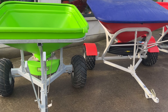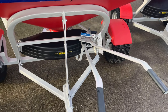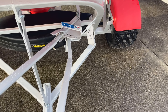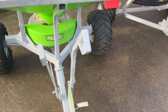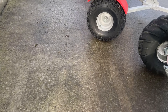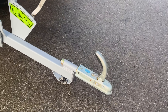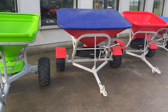If we were to compare the Atchison and the Walco half ton spreaders, there are a few small differences. The mechanism on the Walco is a swipe, whereas with the Atchison it's a push-pull mechanism. There's a slight difference with the tyres as well. Also there's a swivel hitch on the Atchison. As for the width, the Atchison is 5 foot 3 and the Walco is 6 foot 3.